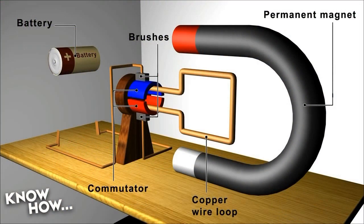This is what a brushed motor looks like in its most basic form. You've got a battery, which is the power source. You've got an armature that contains the shaft, a tightly wound coil of wire, a commutator, and the assembly into which the armature is mounted, which contains the brushes. There's also a rotating mount which allows the armature to spin on its axis, and a permanent magnet. You could actually build this — it's a perfect model you could throw together in a garage and get rotational motion out of it.